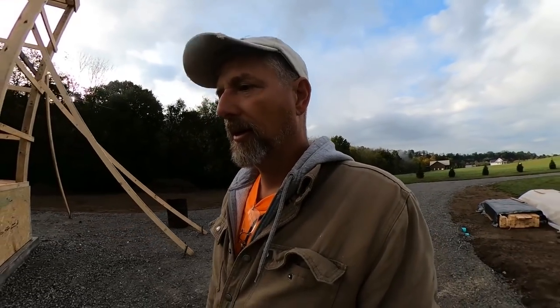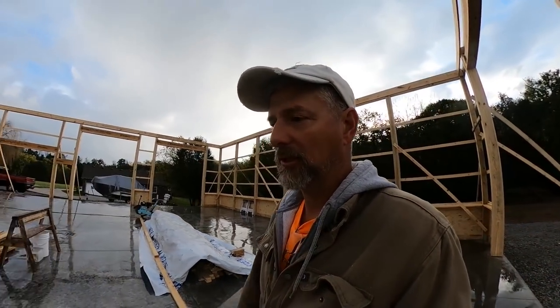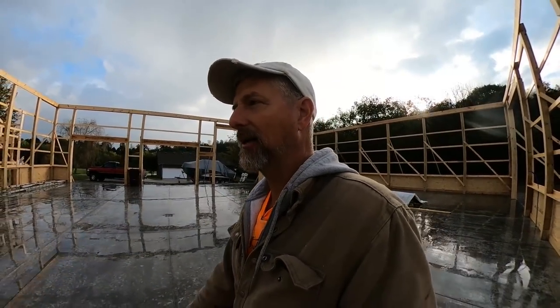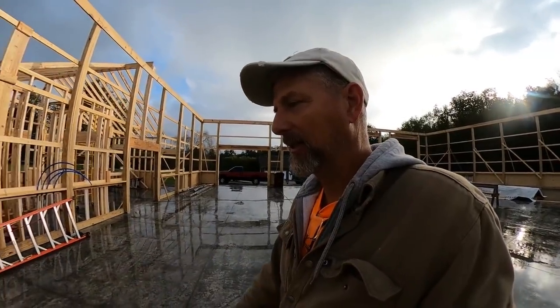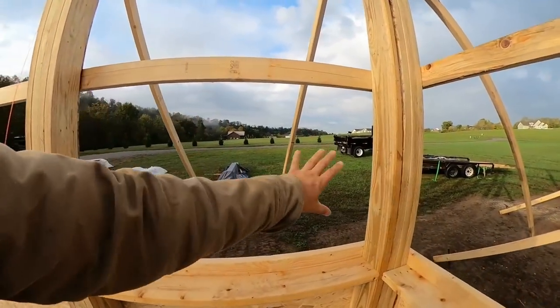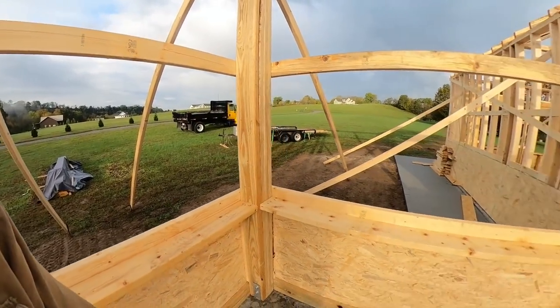So if I wanted to run heat and air, which I definitely do in the office in here, that sucks up a lot of power. You're talking about a $400 difference, and I know $400 is a lot of money, but it's for the rest of your life, and then it doesn't seem like that big of a deal to get 400 amps in here. So my two panels will be in this corner, and then they'll break out from there. So 105 feet works out really well.